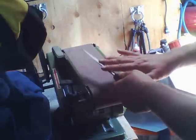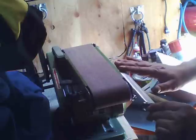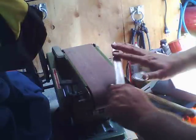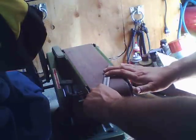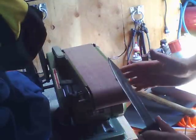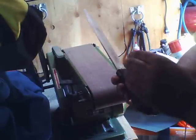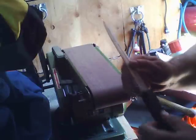And when you work angles on here, the more slender, the more dagger-like blade you might be using, we do this kind of angle to rip down a lot of metal, but when you start really wanting to hone that thing, you're going to start backing that angle off to more like this, and then bringing it down. But when you bring it down to this part of the wheel, it tends to want to stagger a little bit. So you want to kind of work the flat as best you can, and sometimes you're going to nick that little hilt, but again, it's just an old bayonet. It is possible to undo the screws and make your own handle for these things. However, don't discount the utility of that original handle.